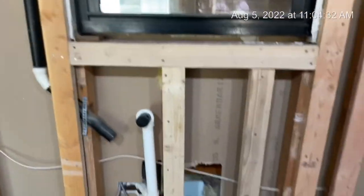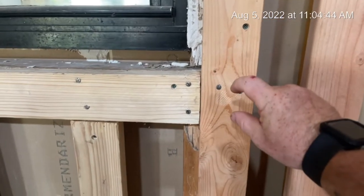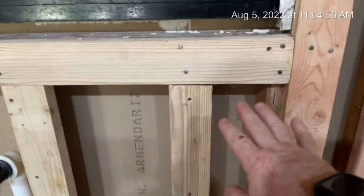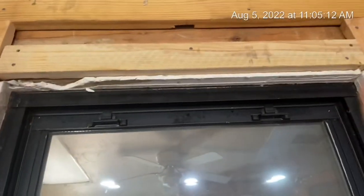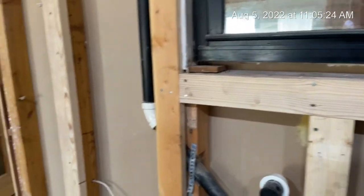I needed some of the wood from the temporary wall to finish framing out the window here. Now if I wanted to do it properly, I would have took this 2x4 and went all the way to the end here and had these studs come up right there, cut there to where they were pushing on the 2x4, so it would transfer the load and give me the ability to make these load-bearing. But since we already have 2x4s in the walls here and they're pretty decent, I just went ahead and put these at the bottom of the sill and at the top of the window. The two boards on the sides go all the way up, but these here are pretty much just to screw sheetrock, cabinets, and all that to.